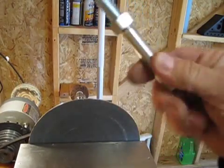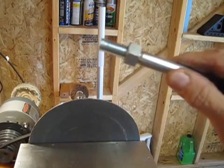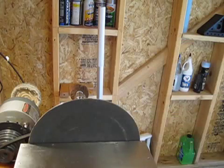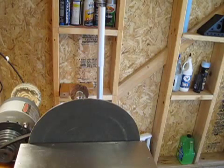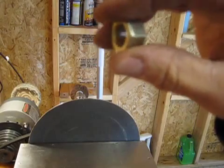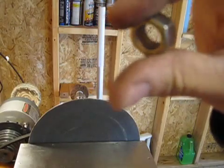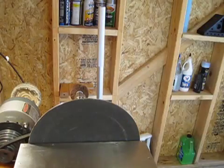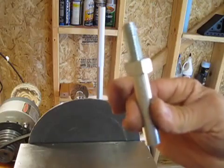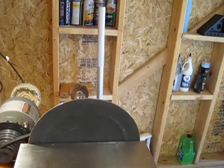When you crank on a nut, if you look closely, you'll see it only goes on so far. So what I do is I drill out 2/3 of the threads on a nut. Then when you crank it on your arbor, it goes on that much further.